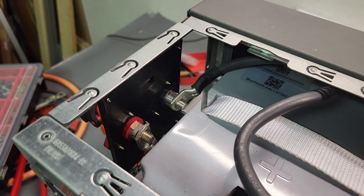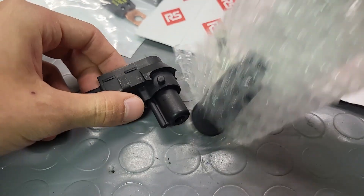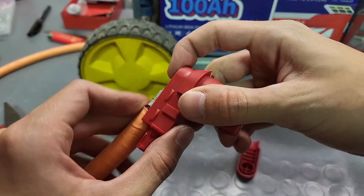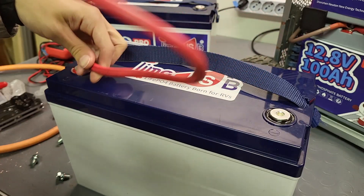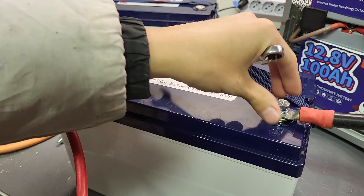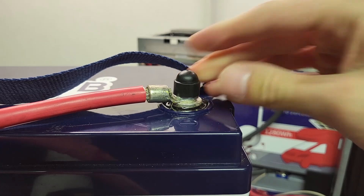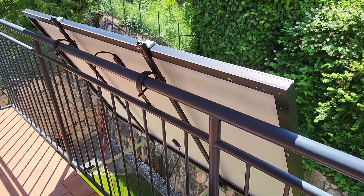Here are the two connectors that will link the external battery. I had to tweak the fuse and shunt setup slightly to make the connection work. These giant connectors at the end of the cables are not easy to crimp — one for the positive red terminal and one for the negative black. Just to clarify: these extra batteries only increase energy storage in kilowatt hours, but not the power output. This wiring setup would not be suitable for increasing power output.